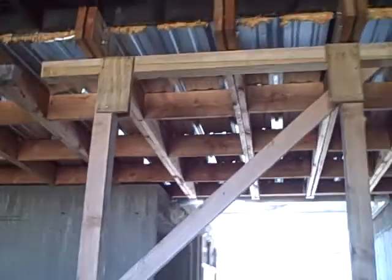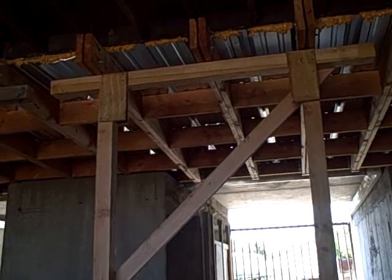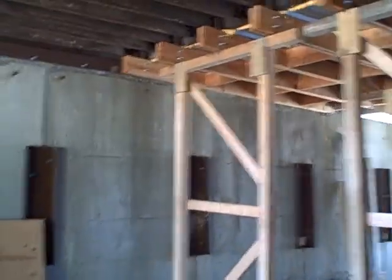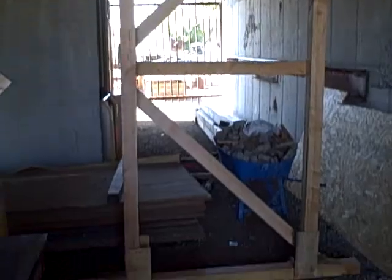These can be spaced 4 feet apart and typically hold 10,000 to 12,000 pounds a piece. Here are 3 of them set up right next to each other — 1, 2, and 3. Top to bottom, that's the vertical shore.